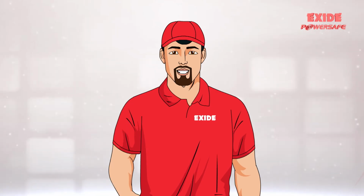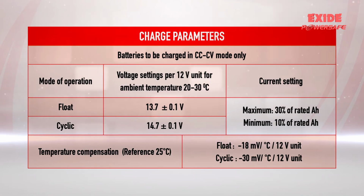Once installed and commissioned, the charging and smooth operation of your VRLA batteries can be done by the following checklist of activities. Correct charging of a VRLA battery is essential in optimizing battery performance and life. Constant potential charges with current limit facility only is recommended for normal continuous operation. This shows the charge voltage and limit current.